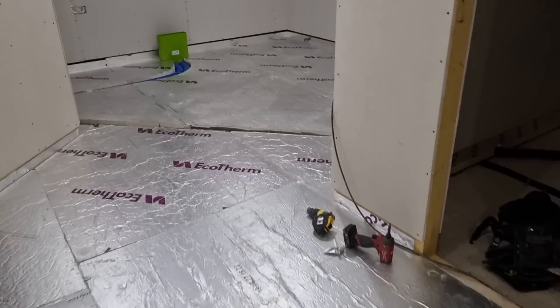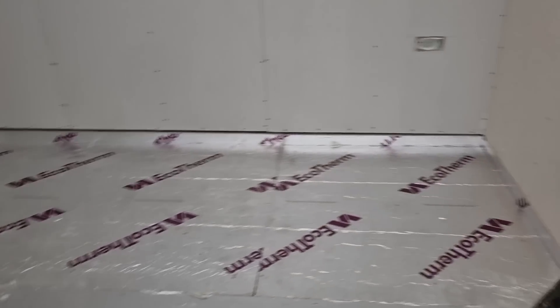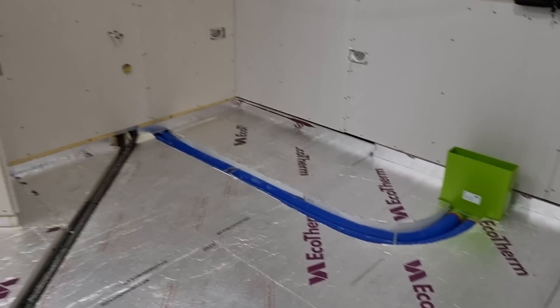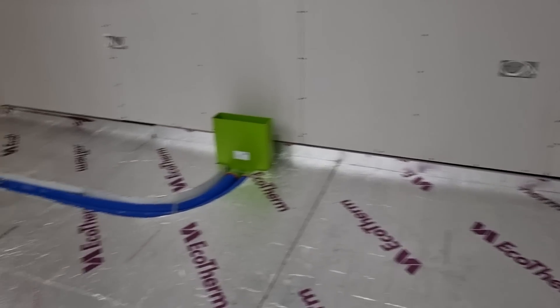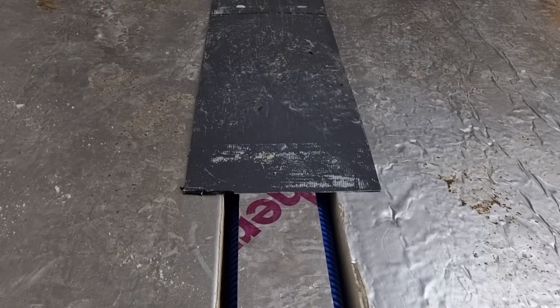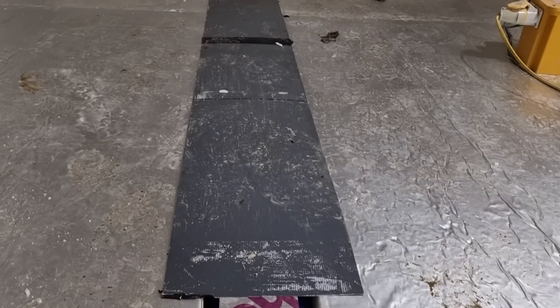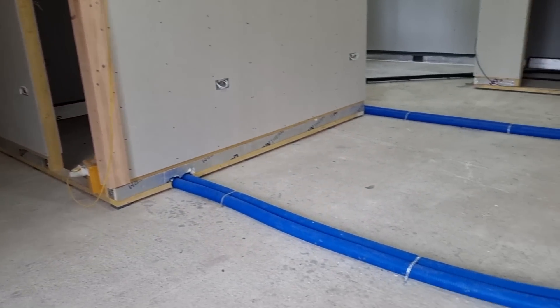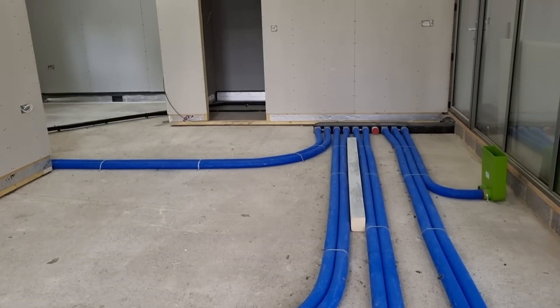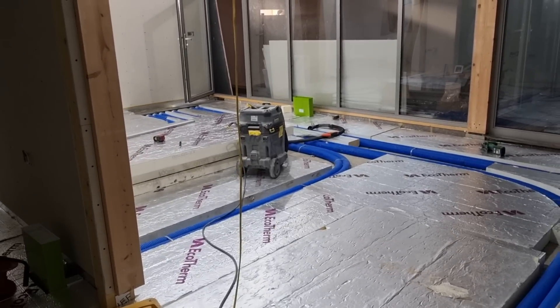There are curves, arcs, and the guys have done a pretty good job — it's just time consuming. The plan is we metal over the channels with a very thin sheet of metal, then go again with 25 millimeters of PIR all over the top. This is some of the metal with a strip of 25 — we'll cut them to fit across both, sitting directly on top of the air pipes for support. Those 25mm sheets form the very top layer all the way across, so you won't even know the 75 millimeter pipes are under this floor. I thought about that in advance and made sure I had enough insulation to account for the MVHR build-up.